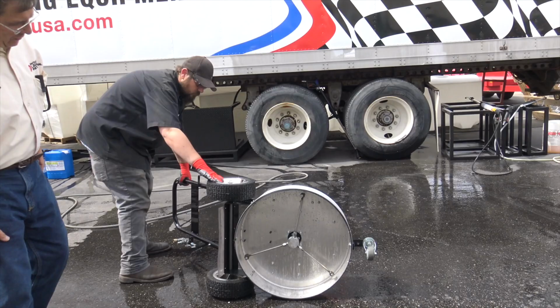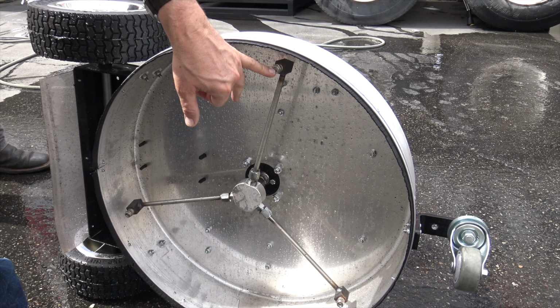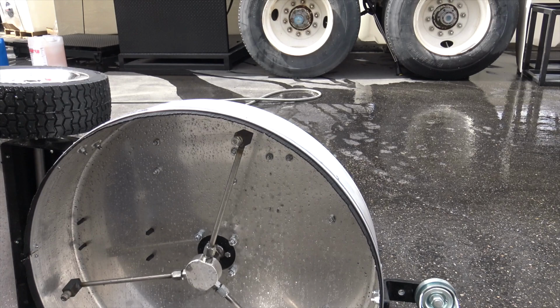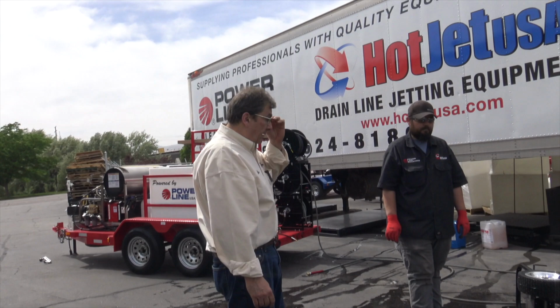So underneath there you've got the three spray bars and the three spray tips. You can vary cleaning performance in a couple of ways. By changing these tips out, you can change cleaning performance, or if they get plugged, you'll know it changed it. Also, if you change the angle on these, by how fast it goes out. We send out a diagram on that, and these are dialed in for each machine. We do a really good job on that. Just kind of want to show that.